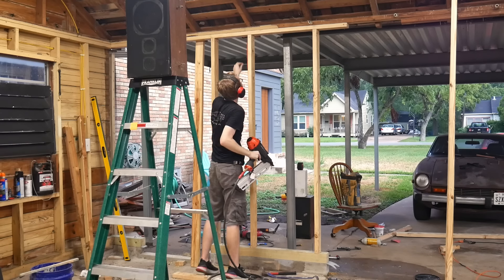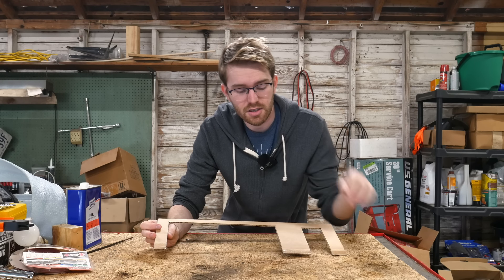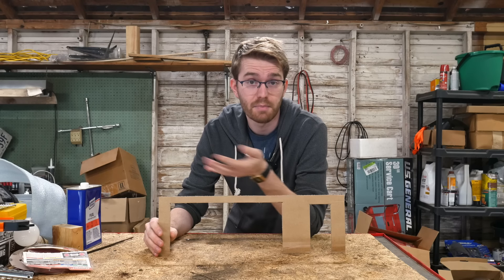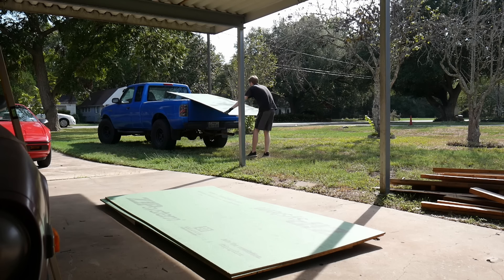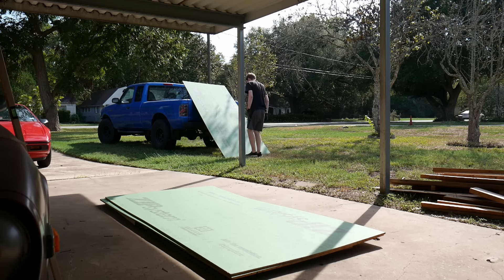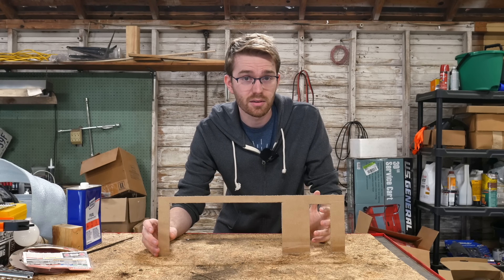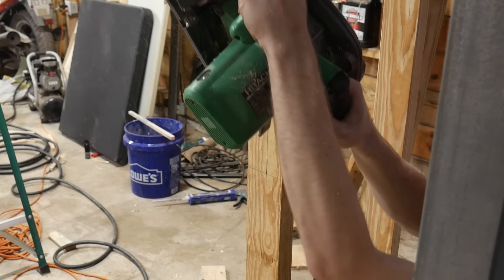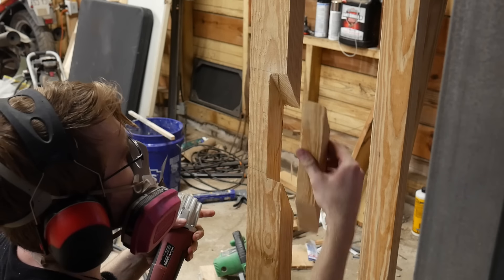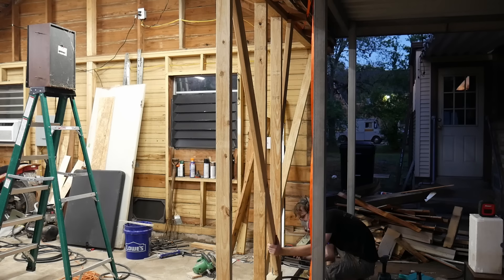But it's not good enough just yet. It hit me that the front of the garage is going to be 80% door, so even though I did buy structural sheathing to hold the walls square and steady, there isn't exactly going to be a lot of wall for the sheathing to go onto. So to maximize the stiffness of the minimal wall there is, I also installed a diagonal brace. It's very possible it's superfluous, but that is better than the alternative.